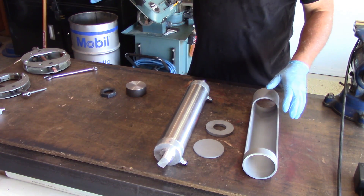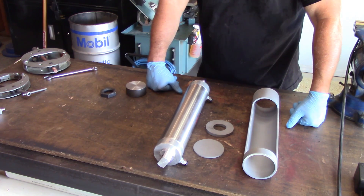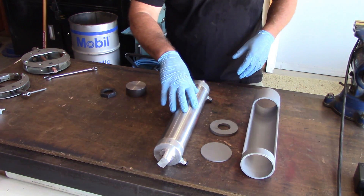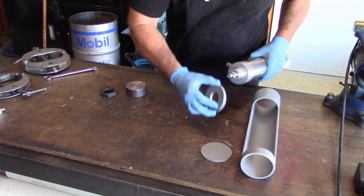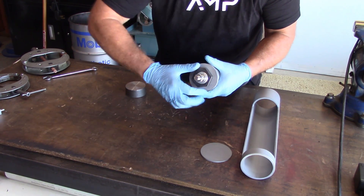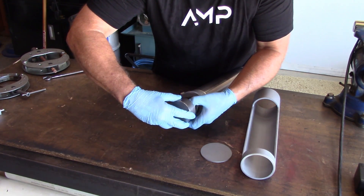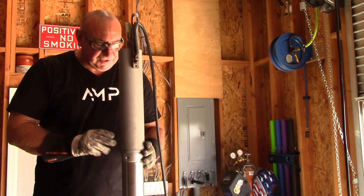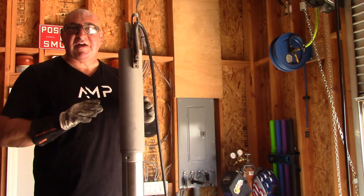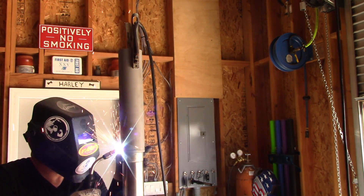Sorry for the background noise — I've had a fan going the whole time. It's been over a hundred degrees for well over 28 days here and it just takes its toll on you. Anyway, I gave these parts a quick media blast and now we're going to preassemble so we can center the cylinder into the crushing cylinder. It's a nice fit — inch-and-a-half 12 for this style cylinder. The puck, five-eighths 18, goes on the rod. I'm centering the sleeve exactly in the middle so it doesn't touch any of the walls inside and just rides freely.